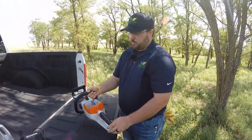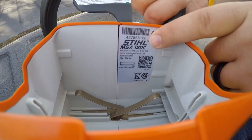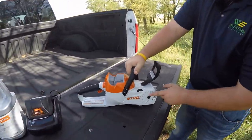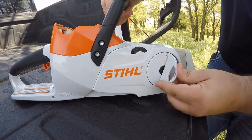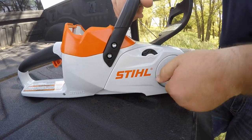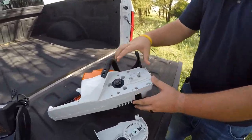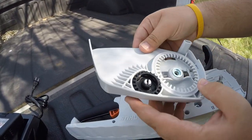Also important, located in the battery chamber is your information sheet — it tells you what size bar you need, the model, and your serial number. That's important for warranty purposes. If the dealership you buy from doesn't register for you, you'll want to have that serial number. Next is the back side, which is your bar cover and tension adjustment. Everything can be done by hand — no tools are required for removing and installing your bar and chain. We'll loosen this up and open the bar cover. Inside is where your bar and chain sit, with your sprocket and screw for the housing. The gears are what adjust your tension.